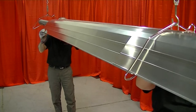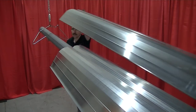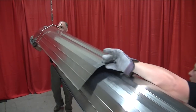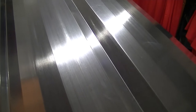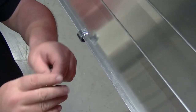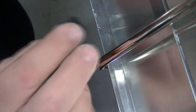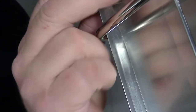Position the next reflector over or under the first reflector, always maintaining a minimum overlap of 6 inches. Install the third reflector over or under the second so the reflectors are stacked and not shingled. Repeat this process until all reflectors are in place. The overlap of the first and second reflector is a slip overlap; every third overlap is considered a slip overlap. If the slip overlap falls inside a hanger, no support strap is required. If not, use a reflector support strap with loose screws to allow expansion and contraction. The remaining joints are non-slip overlaps and can be secured with support straps and wire form with tight screws; if a non-slip overlap falls inside a hanger, two U-clips or sheet metal screws must be installed.